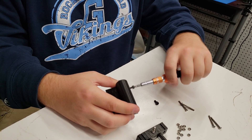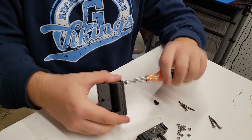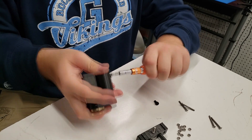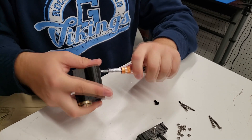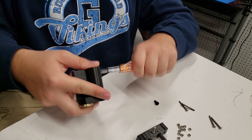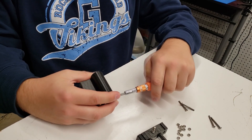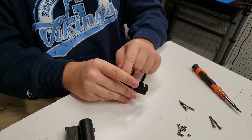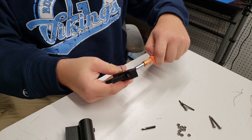With the right side carriage, we're going to insert a couple of socket head M3 screws. What these M3 screws are going to be is something for the tensioner screws to push off of. We've already installed the brass nut just like the other carriage — you install that brass nut the same way. We also did not capture the video for this step, but you can see in the picture the tensioner. It's really just as simple as inserting the bearing between the two washers and then putting a nut through it. Once you've done that and inserted the other screws to push off of, the next piece will be to assemble the remaining part of the tensioner. Insert a couple of M3 nuts, then put M3 screws all the way through — those are the screws that will push off of the socket cap screws in the right carriage mount.